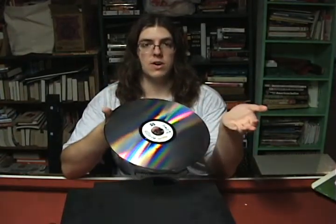These players are also good at reading discs with laser rot. Some of you might remember a batch of CDRs made by Philips that had an adhesive holding the disc to the backing which would actually eat into the disc. Laser disc was the originator of this problem — some early discs had a certain backing used to bond the two sides together, and the adhesive would eventually eat into the aluminum and cause it to oxidize.